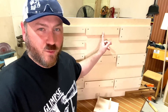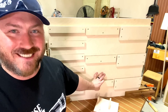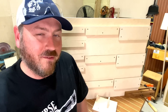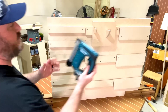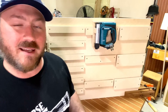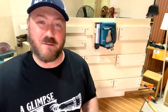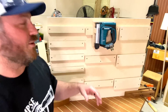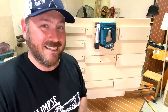Moving on to the next option — the middle one. The cleats are just a little bit bigger, maybe only about a half an inch, but spaced out much greater distances. I've spaced these eight inches here for illustration, but in my shop I use this system spaced every 10 to 12 inches. I don't mind putting these little backer support pieces on. This system is great because it doesn't take much to get organized, everything is in its place, and you can move it around. I like it because I'm not having to cut a ton of 45-degree pieces.